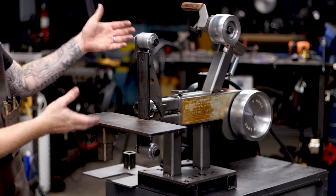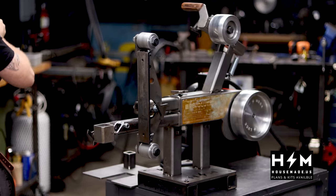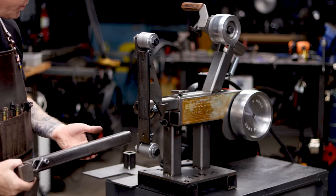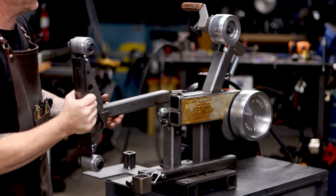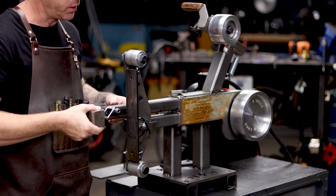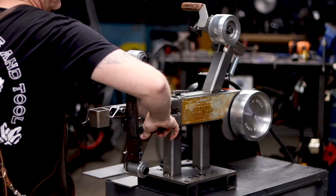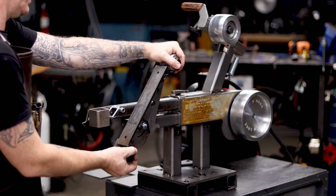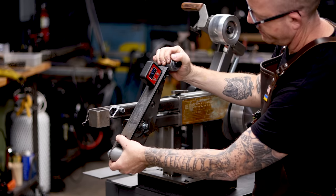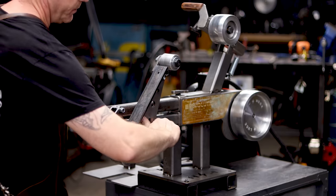This is how a traditional Gen 4 grinder is set up with the standard work rest — that's what comes with the kit. We're going to take that out and set it aside. Here's our newly fabricated — modified, I should say — Gen 4 work rest arm. We're going to pop this out and down into the lower receiver of the Gen 4, essentially just swapping the two. So now the work rest receiver has the platen arm in it and the platen receiver has the work rest arm in it. At this point, you can loosen the knob for the D plate and rock it back to about 50 to 52 degrees — kind of have to play with it.